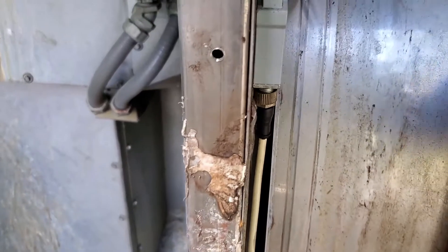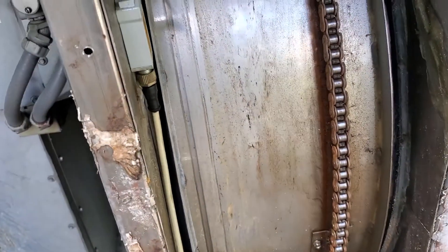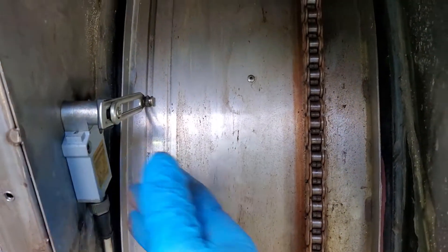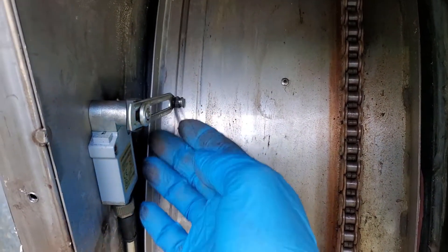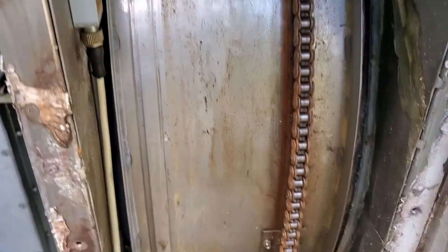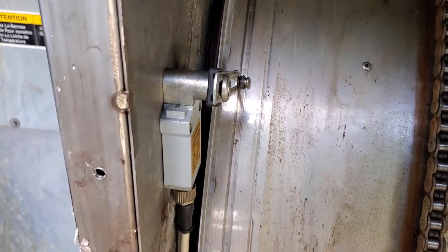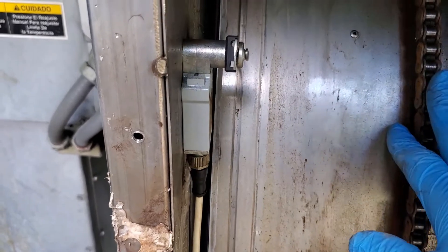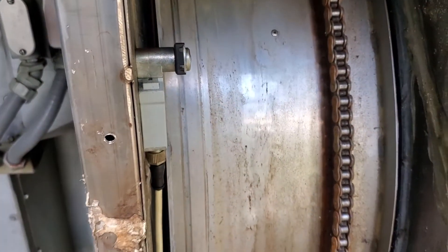We need a new wheel. I'll probably spray a little lube on this chain too — that couldn't hurt, a little chain lube. Let me wrap this up. I'll check back in a minute after I make a phone call, see if I have another one of these switches. For now, since the rink is a little foggy, I'm just going to rig it so it's running. I'll open the other side to look for the little broken wheel, but it's probably broken off. Best bet is to trick it for now — make sure it's moving, have everyone check it every couple hours to make sure it's rotating, then order a new part and replace it when it gets here.